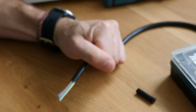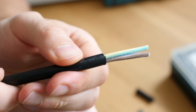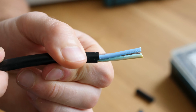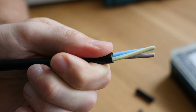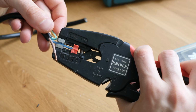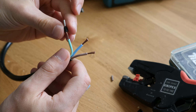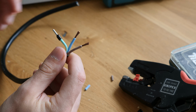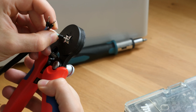Next up, installing the electrical ins and outs, both for AC and DC on the lower side of the housing. If possible, I recommend to connect all cables in the respective components, for example AC sockets, AC in terminals, DC out terminals, before installing the component in the housing. The terminals are generally better accessible when not yet mounted. In some cases, this even is a necessity.